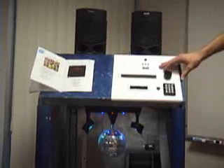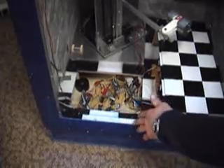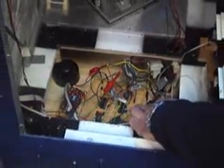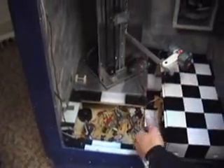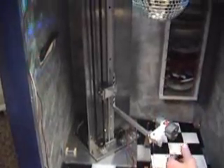Perfect summer song. Primarily, the LCD and the user interface are driven off the keypad. Both of those integrate into an EDE 1144 and an EDE 702. They communicate serially with what we call the main PIC, right here. It handles most of the organization of all the functions. It communicates with the sensor PIC above, and to the right, the arm PIC, which controls both DC motors, the H-bridge inverter, and the stepper motor, as well as the CD tray for all operations of retrieving CDs. All it receives is the CD number and when to open the tray.